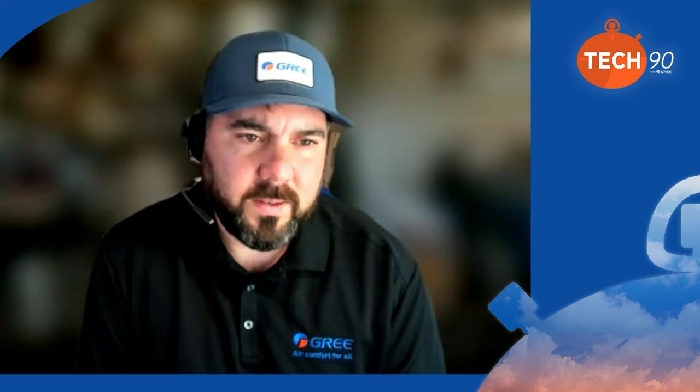Now, the Flex Eco, which is what we're not talking about today, is a different machine, and it does not have service valves. It has nitrogen in it. This has also come up too. GREE inadvertently put stickers on those units saying they had 410A refrigerant in it. So if you get a Flex Eco air handler and it says it has refrigerant, but there are no service valves, you can immediately tell there is no refrigerant in it. That is nitrogen. It's just nitrogen.